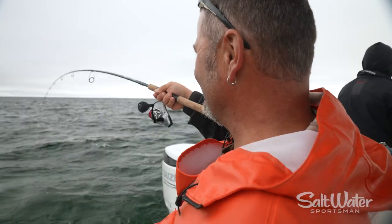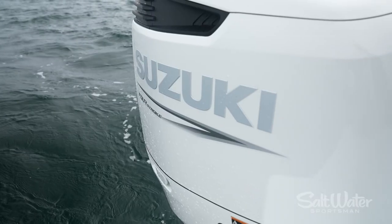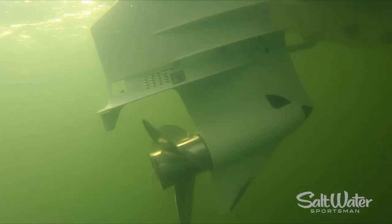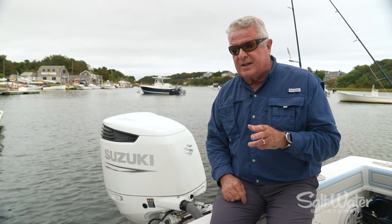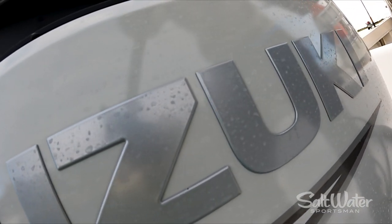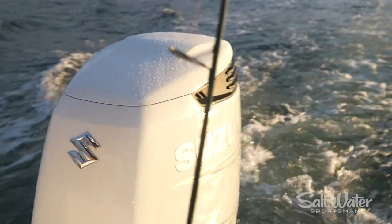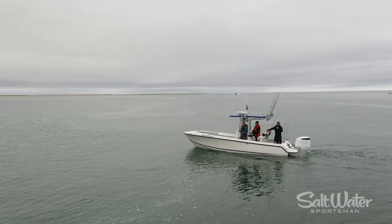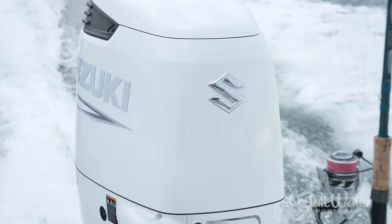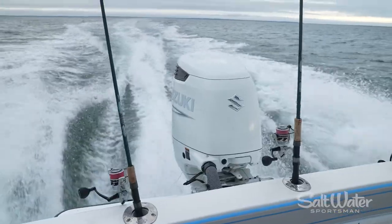The albies love them. That is an albie. Now, we've talked a lot about precision engineering, performance, corrosion protection, and selective rotation. One thing Suzuki likes to say is there's no replacement for displacement. That means that their outboards are built with an engine block powerful enough, beefy enough to generate the horsepower and torque that you need to move a heavy saltwater boat. They've got variable valve timing, so you've got exactly the right amount of fuel and air at the lower speeds, and then it steps it up as you progress to your planing speeds and gives you even more power. Suzuki has engineered what they call lean burn control, which gives you the optimum fuel-air mixture for optimum fuel economy.